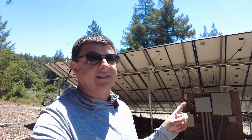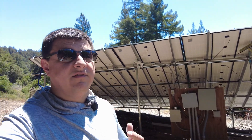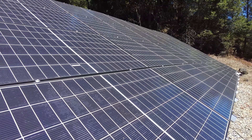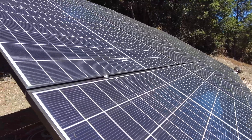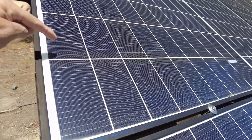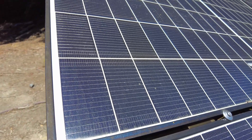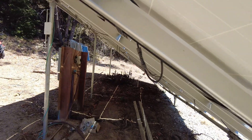Let's dive into what most people think of as the heart of a solar system, which is the solar panels — although I personally would call the inverter bank the real heart. At the moment we have 40 solar panels divided into two separate banks with identical capacities. These are REC solar panels — half-cut style solar panels — so rather than a single full cell, they're half cut, which gives the array generally better shading performance, and we've certainly noticed that.